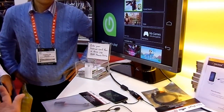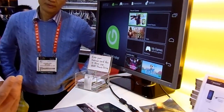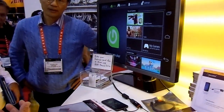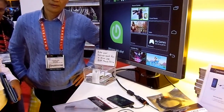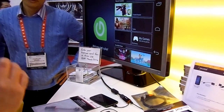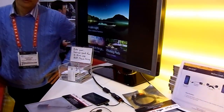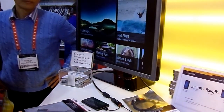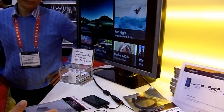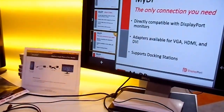In the past, HDMI has been enough. But do you see all these 4K TVs out there? HDMI cannot do 4K at 60Hz — it's a limitation built into the spec. They're working on it, and I'm sure they'll solve that problem. But today, all those 4K TVs are either running at 30Hz, or they're upscaling, or they're doing some other trick. None of those 4K TVs can run HDMI at 60Hz. DisplayPort can — that's what they're showing right over there, with the four screens.